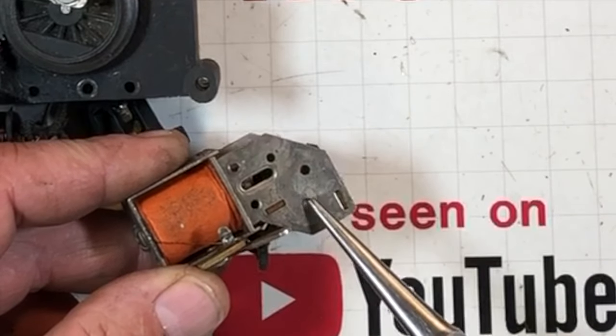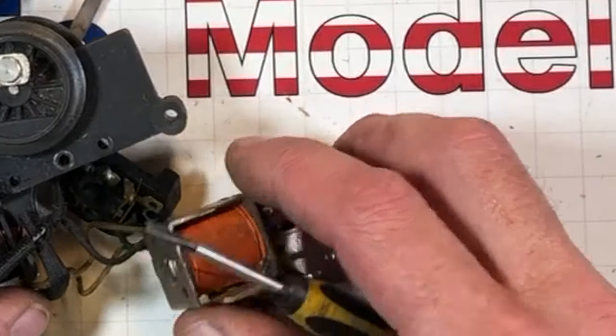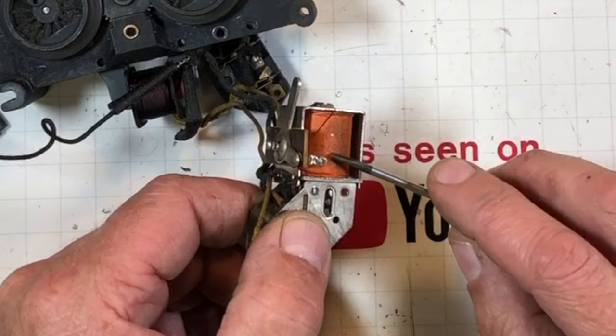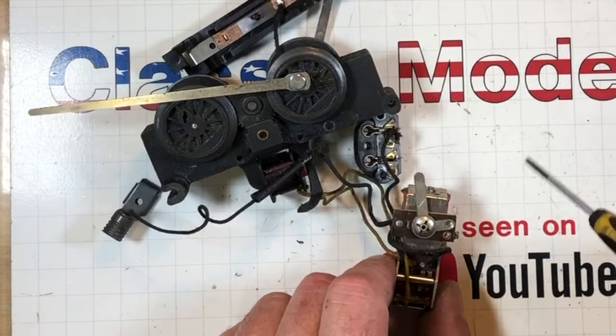Yeah. This one's been swaged together right there. And when you look in there, there's a gap right there, and that's what's allowed this thing to spread just a little bit. This is what connects and disconnects the windings for the solenoid. The electromagnetic solenoid pulls this in, which switches this drum, which gives you your forward and back.